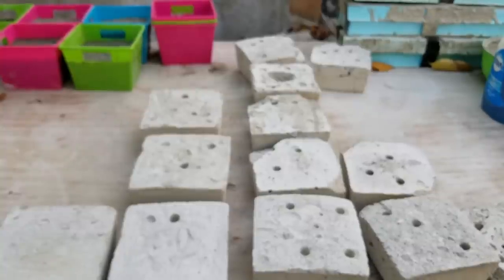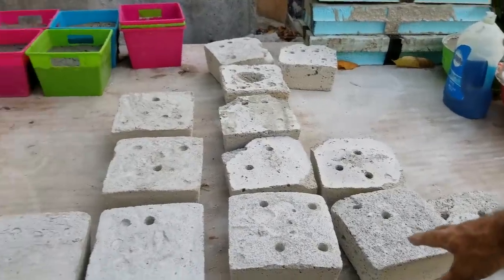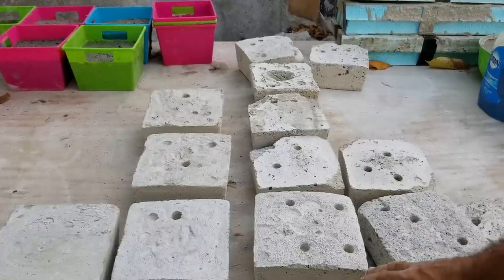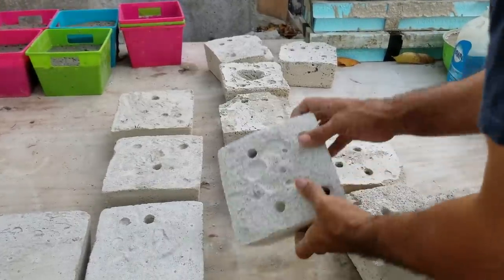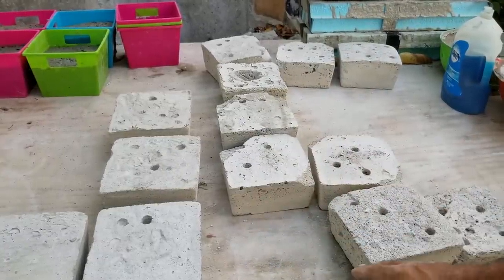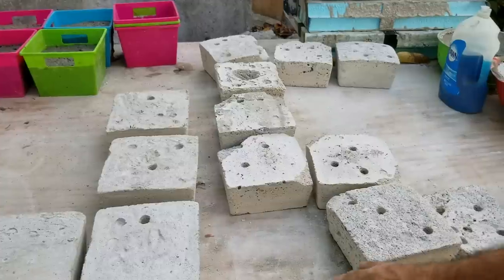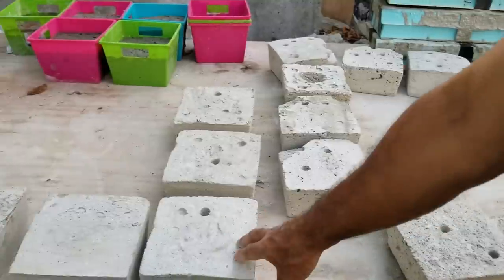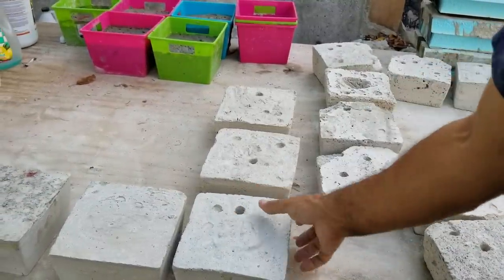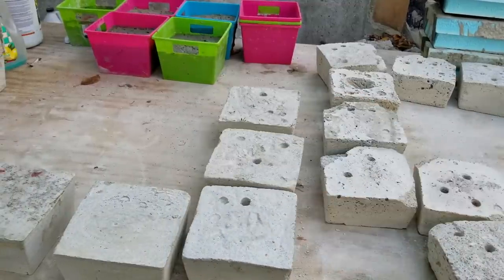What we can see here is that aircrete made with no additives will get stronger over time. The strongest mixes are the ones with less foam relative to cement. The 32-gallon mix is solid — it barely made a dent — strong and still light. I need to weigh all the samples now before I wrap up.